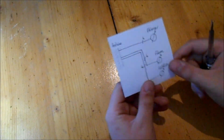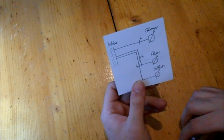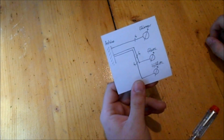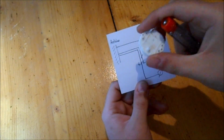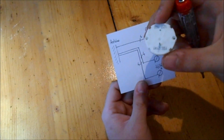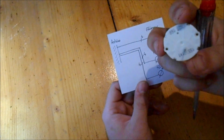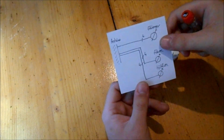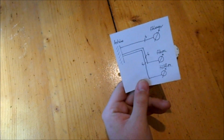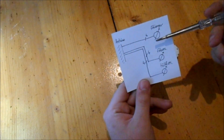Let's see the electronics. I will start from the easier ones. First we have our barometers. Somehow we have to drive them, and of course I won't use 8 to 10 bar high pressure in the room, so we must use stepper motors. I will use X27 168 steppers like this one here. These are industrial used stepper motors. They are used in car dashboards. These are made for moving the needles of gauges. They have pretty low power consumption, so we can drive them from the microcontroller itself. Also there's a library for the Arduino. We need 4 wires to connect the stepper to the Arduino. It's easy to calculate, we all in all need 12 wires for that.